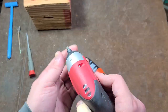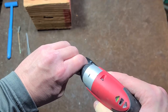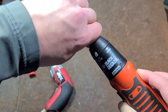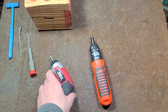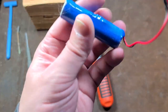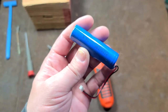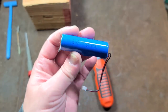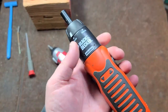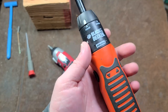I have a Skil IXO here and this thing probably has 50% more power — no way I'm going to stop the spindle with my own fingers. That's actually because an 18650 lithium-ion battery, something like this inside there — even a cheap one — can push 20 amps or more, quite a bit of wattage. Unfortunately, a double-A alkaline cannot push 20 amps, and that's one of the main reasons why this is so weak.